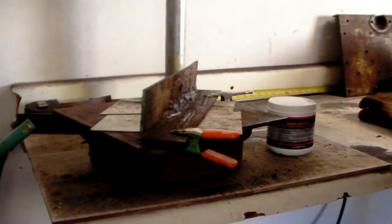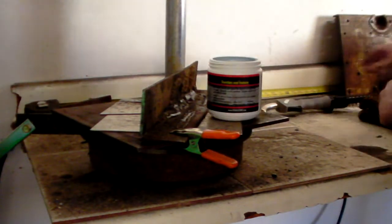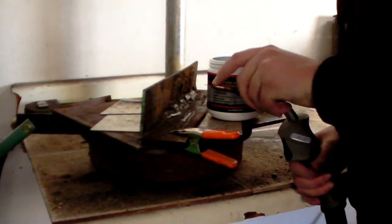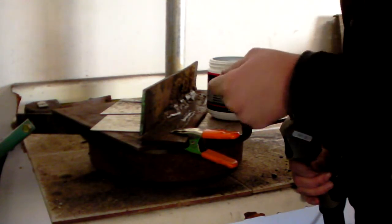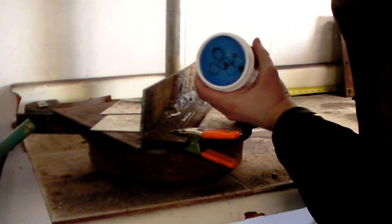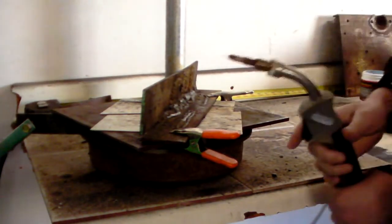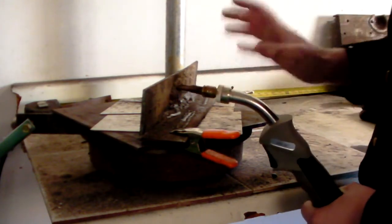The other thing, so this nozzle gel that I was talking about, again, I'm using it. There's going to be some differing opinions on whether you should use this stuff or not. I'm going to, because I've had a lot of buildup end up right on the end of my contact tip while I've been welding, and that has caused some feed issues. So I'm going to be using this stuff to keep that buildup off and keep this hopefully feeding correctly. And all you do is just, you can see I got a whole bunch of holes in there. Just dip it in, get it on, call it good. And voila, you can see a little bit on there. That's just to help keep the spatter and a whole bunch of the other stuff from accumulating and causing feed problems for me.